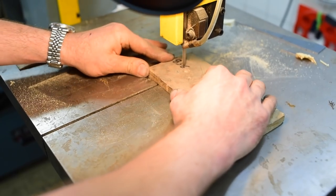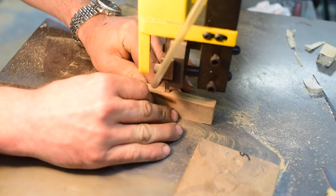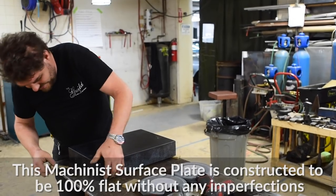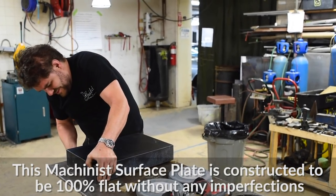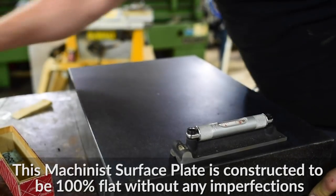Those are the wheels that are out of balance. It's pretty standard — any time you put new wheels on, you have to balance the wheels on the bench grinder. Once you do that, it tends to run perfectly, it won't vibrate, and it does a much better job of grinding things. It's quieter, it's safer, and it all lasts longer.